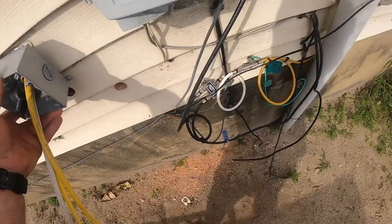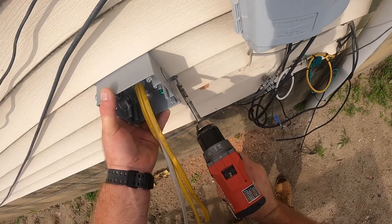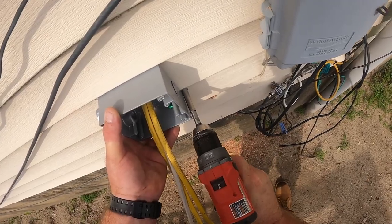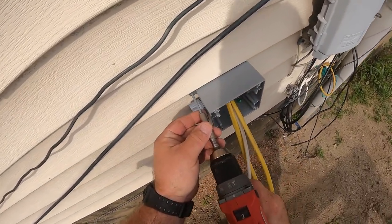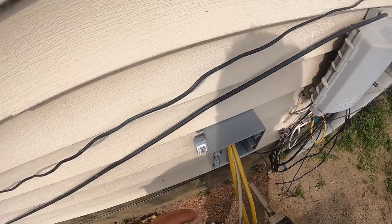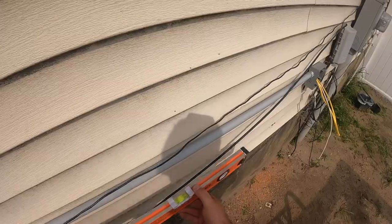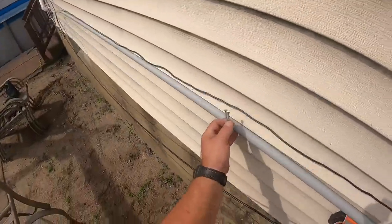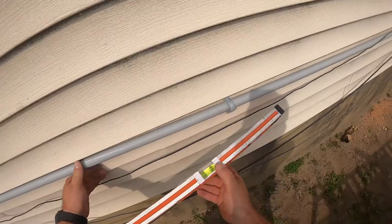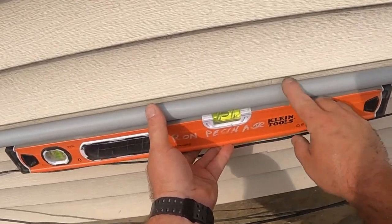Over here by the main breaker panel, which is on the other side of this wall in the basement — you can see the meter and underground service to the right. I've run three circuits that'll attach to GFCI circuit breakers in the main breaker panel. That PVC conduit terminates inside this box, where we'll join the THHN/THWN wires that'll be pulled through the conduit. They'll be spliced to the home runs inside this two-gang weatherproof box. Make sure you run PVC conduit with a level — take your time and make a nice clean run.